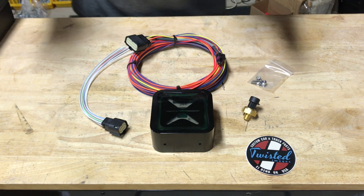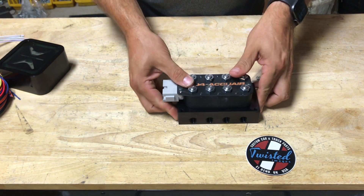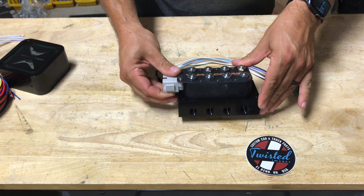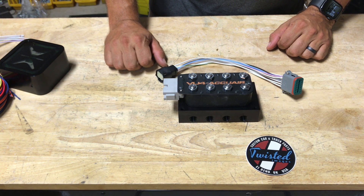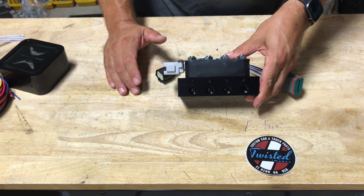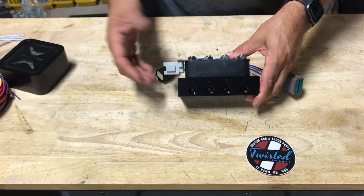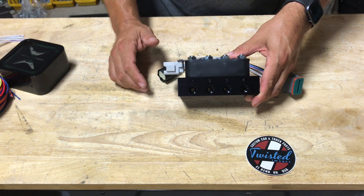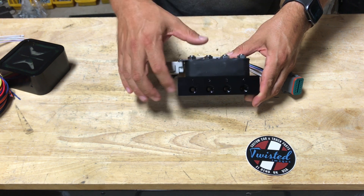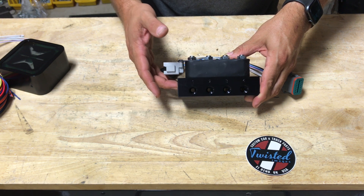The one big change to the product lineup is they're not doing the VX4 valve manifold anymore — they went back to the VU4 design. These are available now as well, and that's fine. This was tried and true, a very good manifold — it's compact. This is the threaded port version, which they had switched to later in production before the VX4 came out. They got rid of the cartridge-style pre-installed fittings. This gives you a little more flexibility for doing hard lines, for doing 90s straight out of the valve, and if you mess up a fitting, it's easier to replace a single fitting than have a cartridge that you'd need to send in for service or risk damaging trying to change it out yourself.